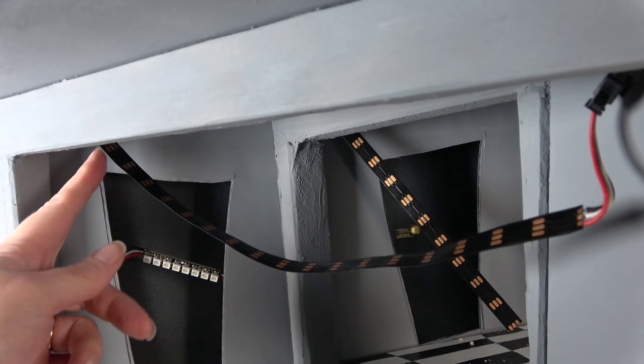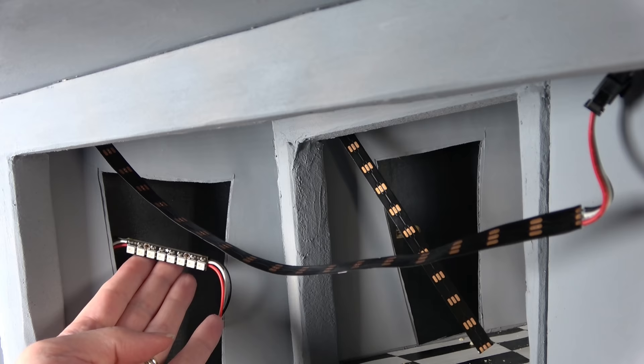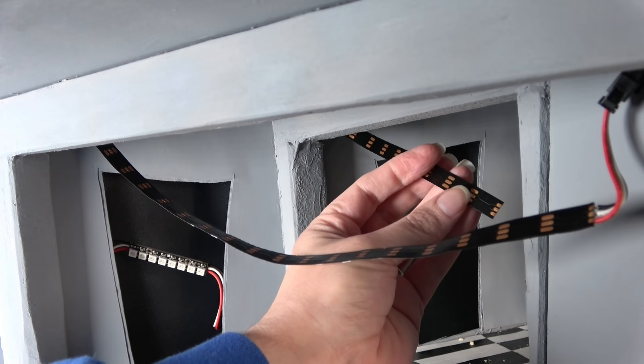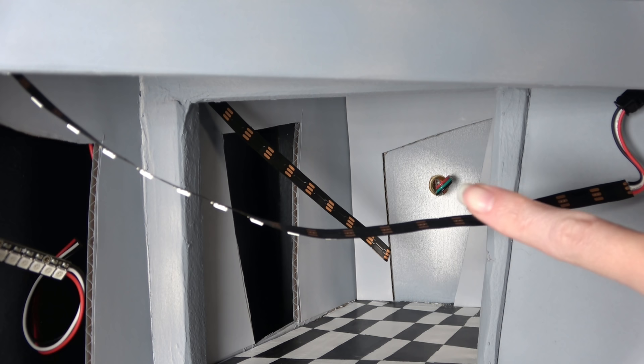The white is what's sending the computer program to the lights to tell them what to do. The smart LEDs will have all three of these lines - power, ground, and data. The dumb LEDs will only have two which are the power and the ground. We are still continuing down line one which is going to this light which is behind the lost souls door. If you remember from Beetlejuice this one is supposed to light up green. Then it goes through the wall one more time to this long strip of LEDs which are going to go up behind this beam so that they're hidden. And because this is the end of the lights this is where that power is going to loop around and go back down the ground.